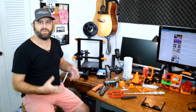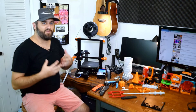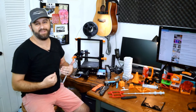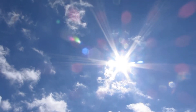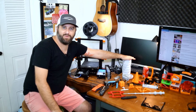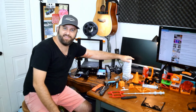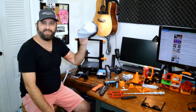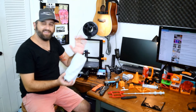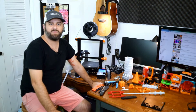When it comes to cars, we know they sit out in the sun and in some heat. Anything that goes into a car needs to withstand those temperatures — especially here in Florida, where it gets brutally hot in the car in the summer. Things like PLA plastic have a low melting point, or low glass transition temperature to use the proper terminology. All that means is this thing will melt. If I put it on the dashboard in the sun and come back in two hours, it's going to be warped — or depending on how hot it gets, just a flat pile of plastic.